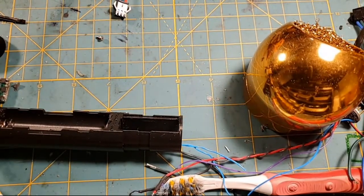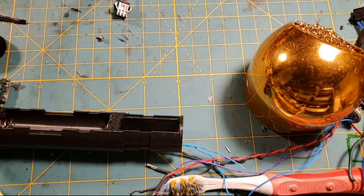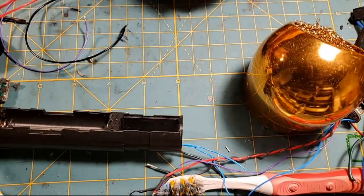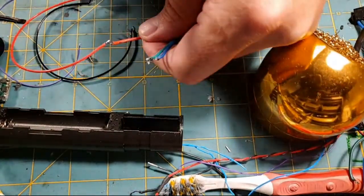We're going to test. So I'm going to get some solder, and I'm going to pre-tin the ends of all these wires, and I'm going to attach a NeoPixel plug to it, and then I'm going to hook on my handy dandy test rig. Okay, green is data on this one, so let's see here. Let's get some red. Now then, I'm just going to temporarily tack these wires to the test rig so I can quickly untack them. And try and get you in here where you guys can see what I'm doing. Here's the test rig plug. I'll show you in just a second. The damn camera just keeps moving. Stand by.